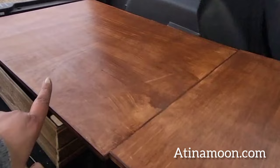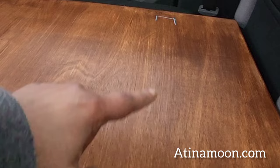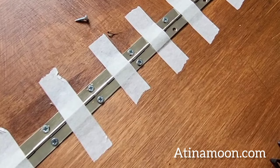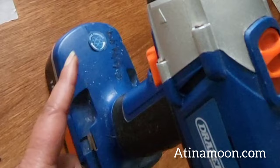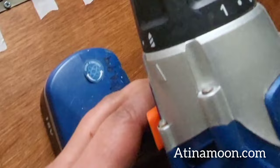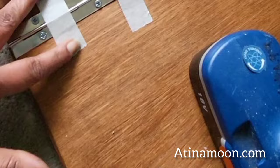The long piece of wood is underneath in the perfect position for that to be flush. I've used chalk to guide me to where this piece of wood is going to be so I can nail it. I'm drilling in the screws for the piano hinge — to keep it in place I've used masking tape. It may not be the correct method but it's working quite well. Disaster! The battery went on the drill. I put the replacement on and that's a duff battery — it's not working. But I've nearly finished screwing in the piano hinge. I used masking tape to secure the hinge so it doesn't move around while I was screwing it in.